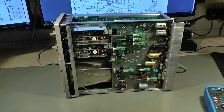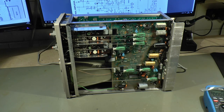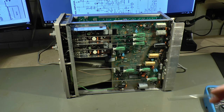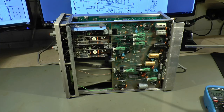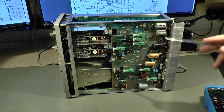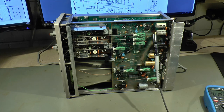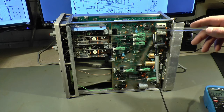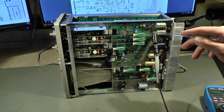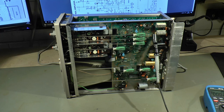Switching the scope on, we can now measure voltages. For a ground reference, I always look at the thick ground plane parts of the circuit board and then probe between some capacitors to verify. In this case we can even look at the manual to see which part of the capacitor is actually grounded. We can see the second-from-top electrolytic capacitor has a ground on the left, so I'm going to hook our multimeter to it. Always be careful hooking crocodile clips into equipment that you don't short anything out.